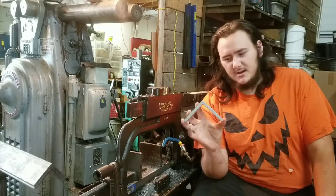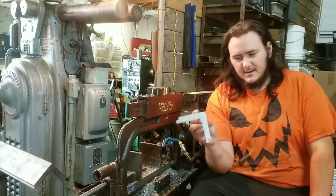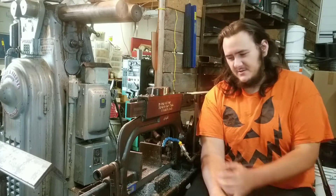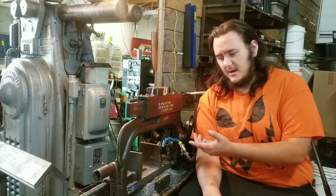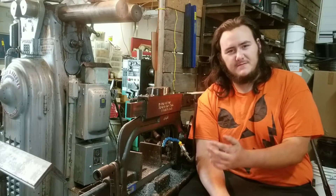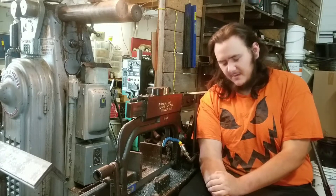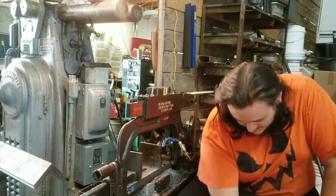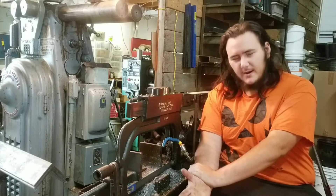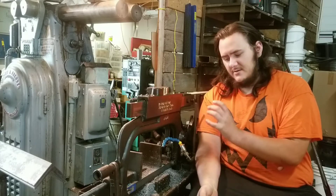A hacksaw is not good at cutting structural elements like this. I cut two of these stacked up and it took me 15 minutes — that's quite a long time for this saw to cut a structural element, especially when you consider that it cut a two-inch by six-inch forklift tine, 40-hardened 4140, in 20 minutes. It cuts thick steels so much faster than it cuts structural steels. I don't quite know why, but it does.